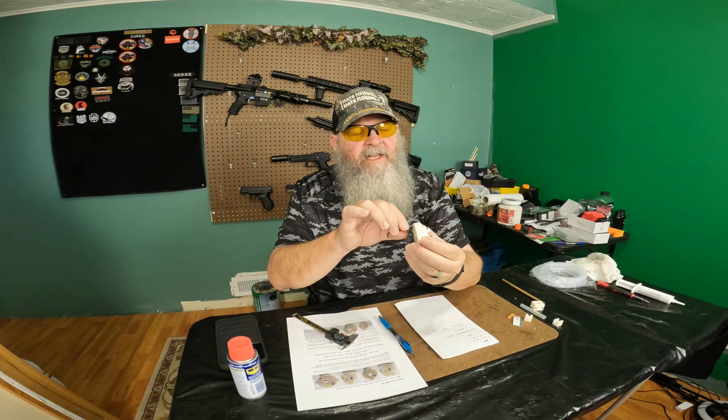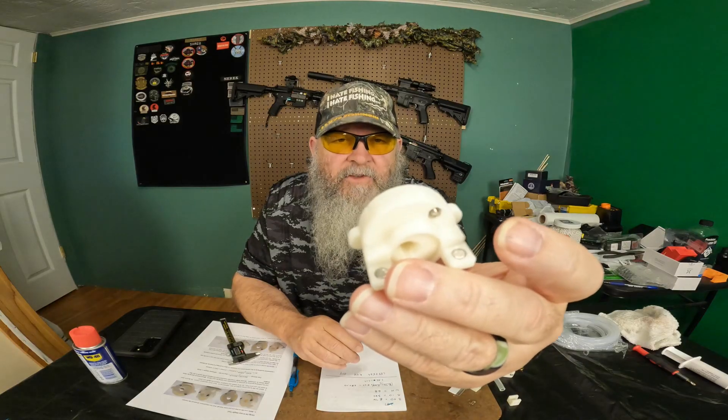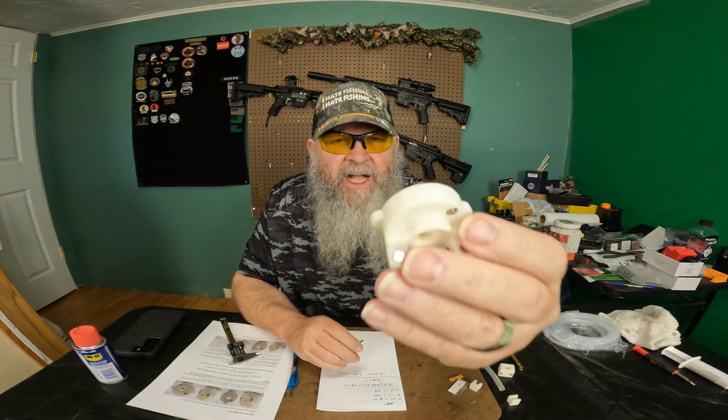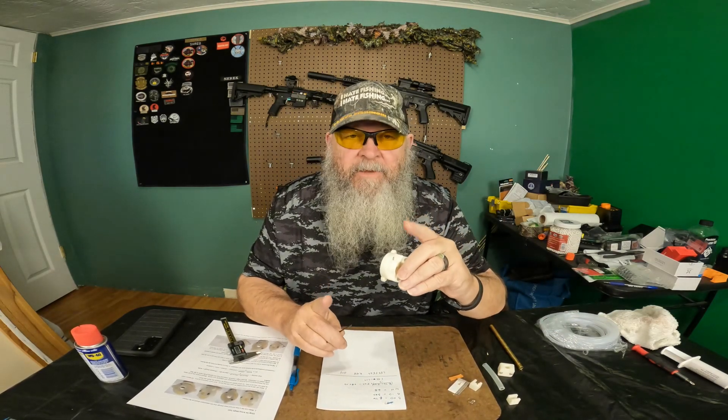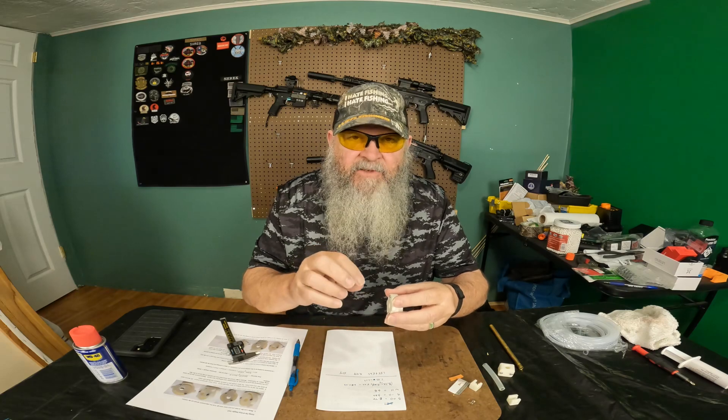To cut our patch, the first thing we need is the height tool. First step is to tighten it just a little bit so it moves kind of hard. If you look on the top of the tool, you'll see little notches — each notch indicates 0.2 millimeters. I got a reading of 0.4, so I'm going to adjust to the second notch and then tighten it down securely.